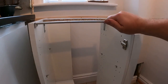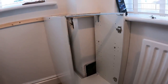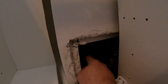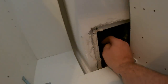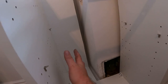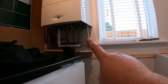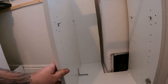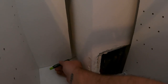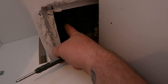With the rad done, we're going to put this unit into this corner. The customer's put the batons on, trimmed the unit, and got it to where it is — we've just got to put it into position. We've got a little stub off the stack in there, so I'm just going to mark it up here, come through with a bit of inch and a half, then fix the standpipe to the side of that cupboard, fix it all in, and then that side is done. Then we can get on and bring the cold main down. Let me find my pencil and mark up exactly where the side of that unit is so we know we can drill through and hopefully get onto that boss.